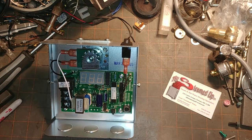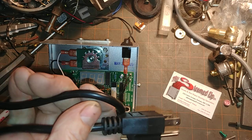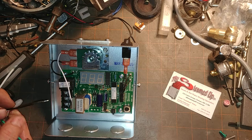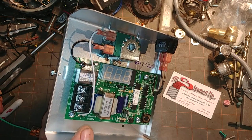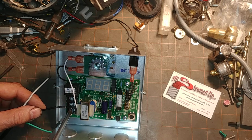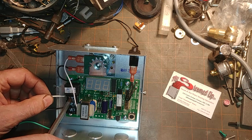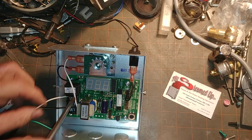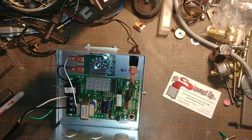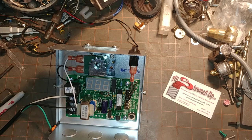I'm going to see if we can wire this thing up and do a quick test. I'm going to use this three-pronged cord with a switch and go ahead and wire it up. We want to go black to H and N for white. Generally, you want to have that ground wire covered over because it tends to wander and find a hot on its own. I'll plug this into my power strip here.